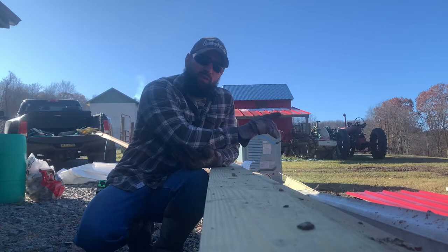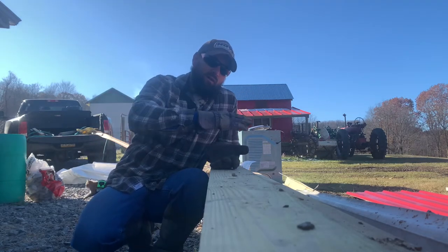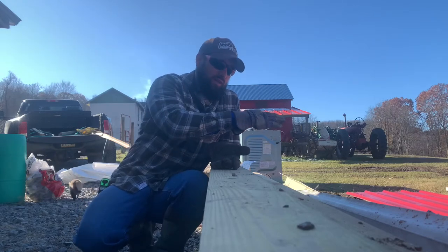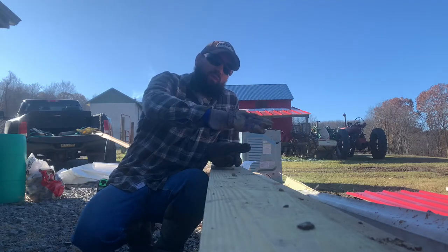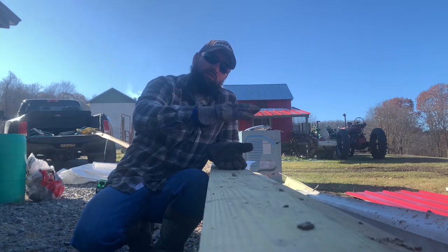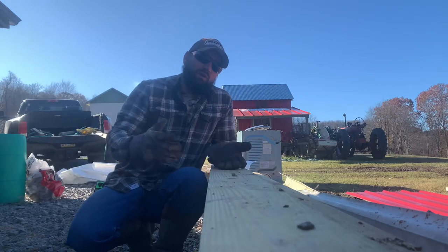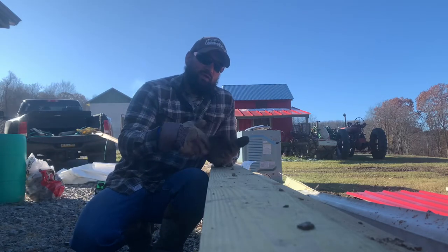And then we still need our 2x8s for the outside fascia board, because we're running our runners on top of our lean-to where our metal screws down. We're running those all the way out. And we got a 2x6 at the end, and then on top, we're putting 1.5 inch 2x4. So it's gonna measure out for a 2x8. It's gonna be a perfect fascia board. And then we can mount our gutter or put our fascia on or whatever you want to do.